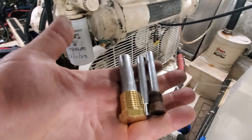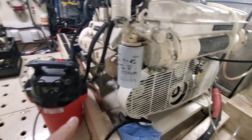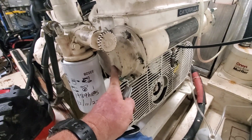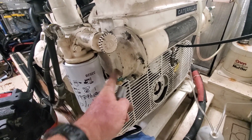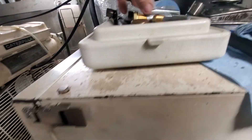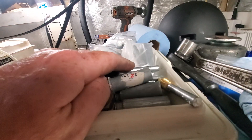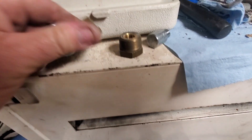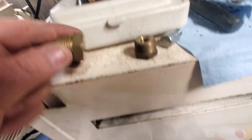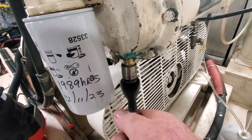I found one of these skinny ones. I'll show you on this engine — heat exchanger. This is the port engine. On the inboard side, there's a big plug, which is this one. So there's three on the heat exchanger, and then big stubbies. This one on the heat exchanger, that's a 7/8ths to get it on.